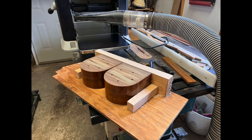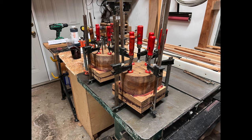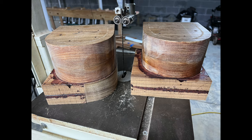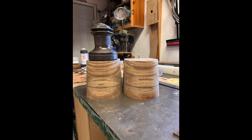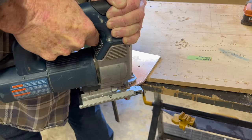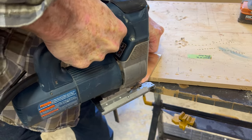With the top of the base flat, the next step was to glue on an extension. I couldn't find any affordable two-inch-thick off-cuts, so the best solution was to glue together some one-inch-thick teak scraps left over from other projects. As before, I used Aerodux 185 resorcinol glue. Once the glue had cured, I glued the new two-inch-thick piece to the existing winch pads. Once cured, I took the pads to a friend's bandsaw and cut as close to the original base as possible. With the pads back in the shop, I used an inexpensive bench-top sander to sand the extension flush. I decided to add a slight bevel to the now-taller pads so they'd have a more refined look. Once I was satisfied with the shape, I used my trusty Bosch jigsaw with bimetal blades from Lowe's Hardware to cut a quarter-inch-thick silicone bronze plate to fit the top of the winch pad.